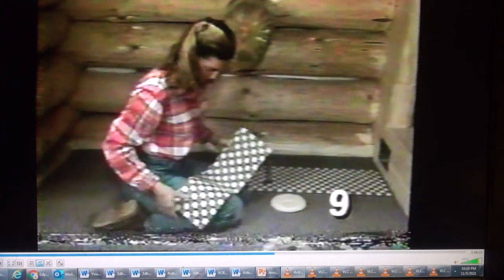I've made some pretty good progress up here on the second floor. The 4x4 wall tiles are all in, and they've started on the floor tile. These are 1x1 mosaic tiles, and they're in the same jade and almond color as the tiles we used in the basement. Since the log surface isn't perfectly square, I've had to scribe along here and nip all these tiles so that they'll fit.